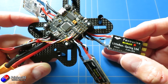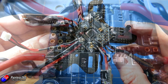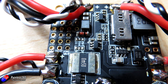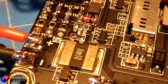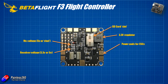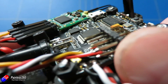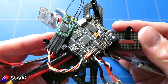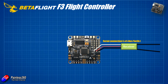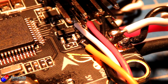Let's go back to the start and talk about what we've actually done. This board is slightly different from where we left it last time — there are some extra pieces soldered on. If we turn it over, you can see we've connected the voltage for the receiver to the 5-volt pin on the bottom, and we've also connected the voltage out or the RAM pin to VBAT for traditional FPV technology. That's the last bit of soldering needed underneath. We've also connected up pins to UART2 and the signal pins of UART3, and hardwired the cables for the XM+. It's an SBUS receiver, so we've connected it up to the first four pins. I've also installed a wire onto the telemetry connection, though I'll show you a little trick — we don't actually need to worry about that.